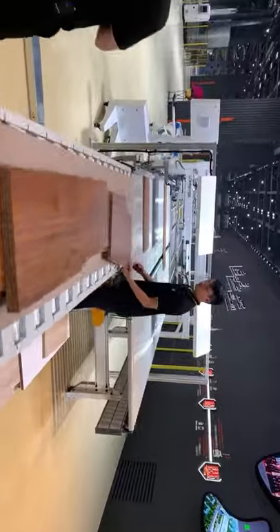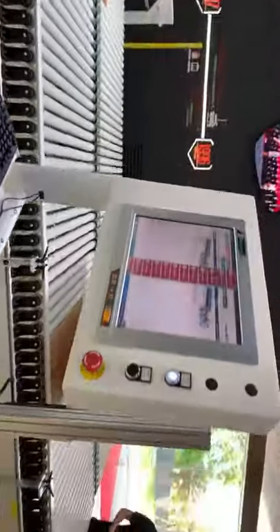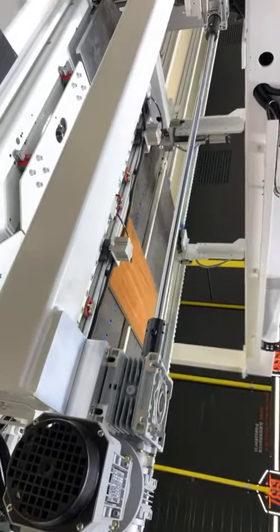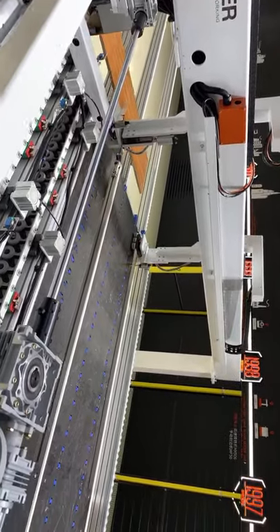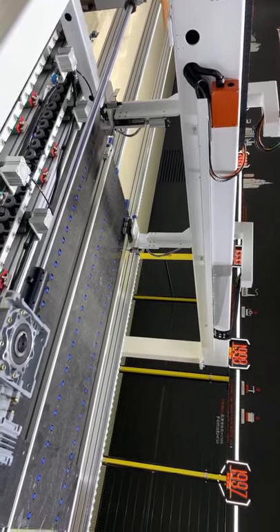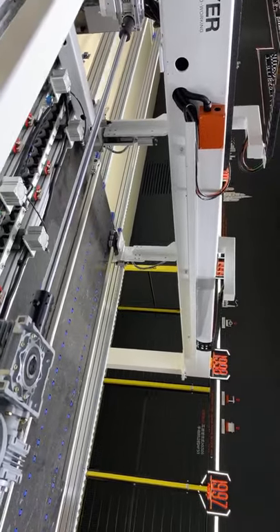Please follow to see our left and right line. From this side view, we can see very clearly and in detail how the side alignment device does its job. When the workpiece is bigger than 1.2 meters, the first unit raises up and then the second one does the side alignment. But when the workpiece is shorter than 1.2 meters, the second one stands by and the first one goes down to do the side alignment.